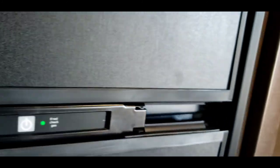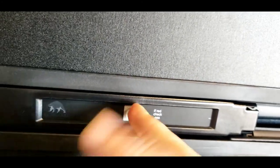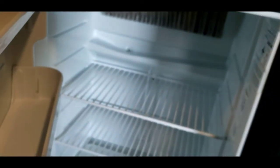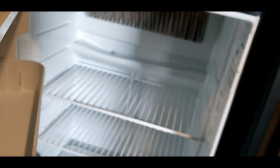And then your fridge — very simple to use. That's off, that's on. Its only mode is automatic, so when it's on it's going to default to 110-volt electric. If the camper is plugged in, that's what it's going to use. If you were to lose power somehow — someone tripped over the cord, a campground loses power — it's going to automatically switch to running off of propane, provided your propane is on. Whether you're running on gas or electric, this fridge is going to take eight to ten hours to get to operating temperature, so keep that in mind and try to plan your trip accordingly. Don't think that as soon as you get to the campground and plug your camper in it's good to store food in — it's going to take a little while for that to get cold.